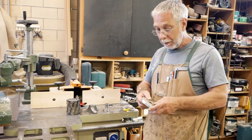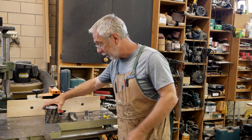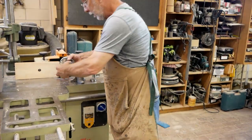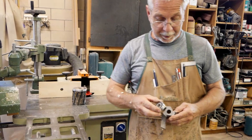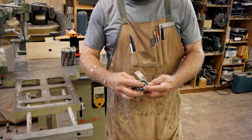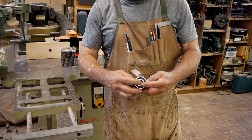Along with the shapers, there are also bearings, which are called rub collar in the shaper world. So usually you have your rub collar, and it sits flush with your cutter. You want to offset, you take your rub collar and put on there if you want just that flush, but if you want a little flare in there, you can reduce your rub collar down and give it a little flare.